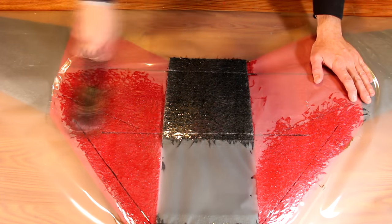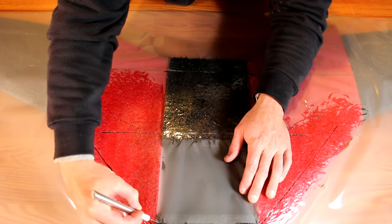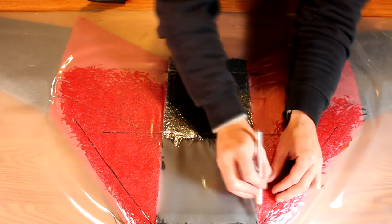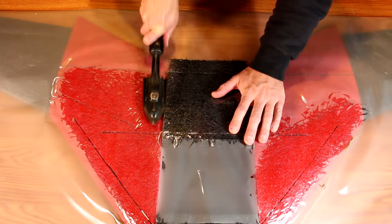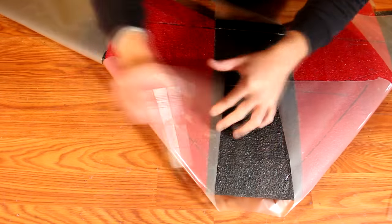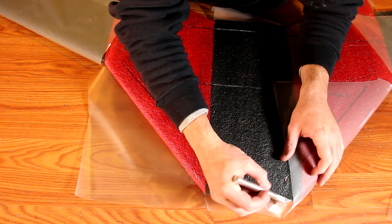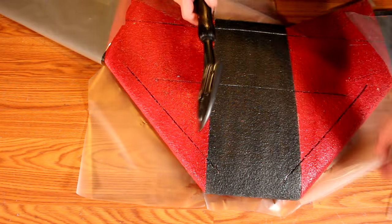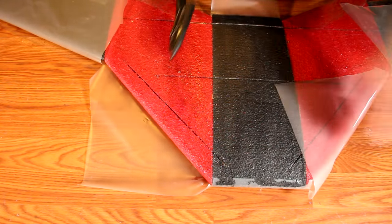Use a good amount of pressure and press down solidly on the iron to get a good bond. You don't need a covering iron — you can simply use a clothing iron at approximately 220 degrees, just barely hot enough to boil water on the iron. I recommend wrapping the laminate over the leading edge of the wing when coating both sides. This will give two coats of laminate along the leading edge, which greatly strengthens the airplane in the event of a crash.